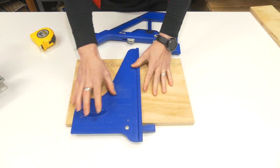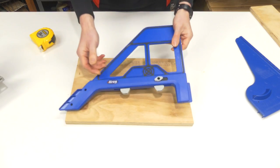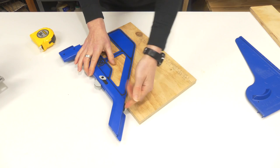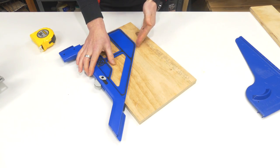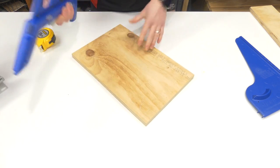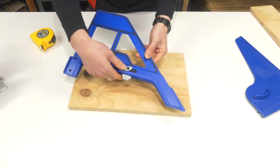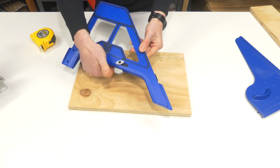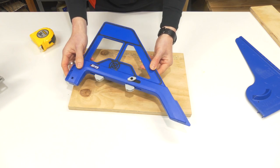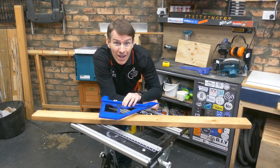That is where the disadvantages end. The square cut butts up in one direction only — it can only do 90-degree cuts. The big party trick of the portable crosscut is you can turn it around and suddenly you're cutting at 45s, and that is a massive improvement over the old design, putting it up there with a traditional speed square, just bigger. The real kicker though are these nifty cut guides — we're going to show you how to very quickly calibrate those. I've got a standard 2x4 bed slat to demonstrate how to set this up and how it works.